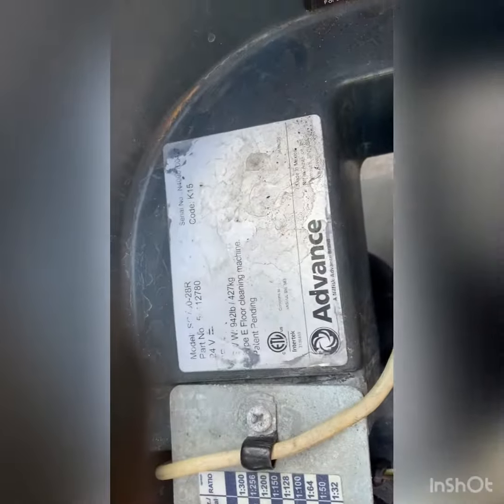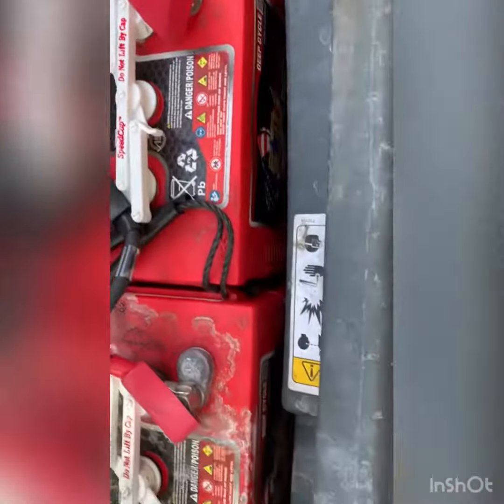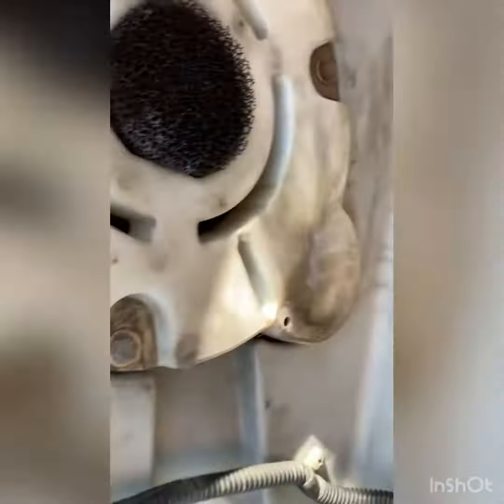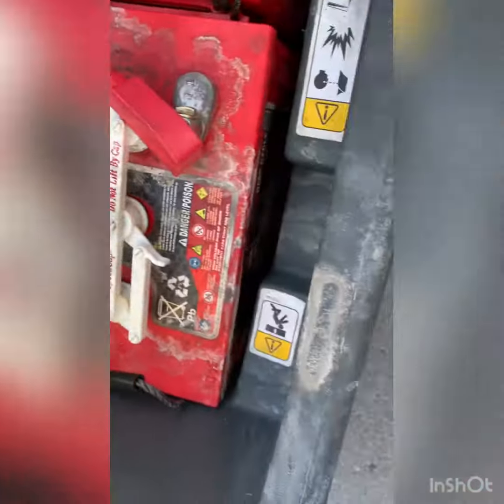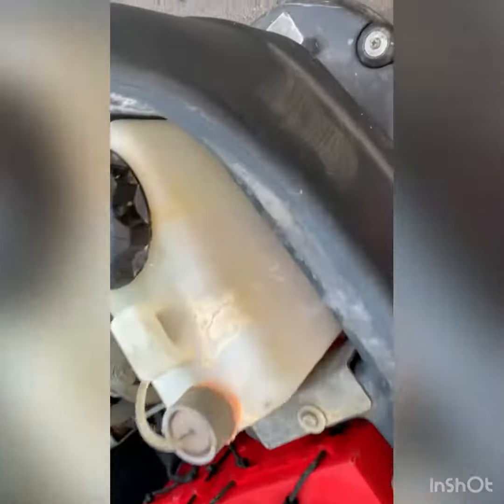This unit here is a SE 750. Batteries were recently replaced — they must be overfilling or getting some water. That's coming from the recovery on the battery tops, and that's not good.